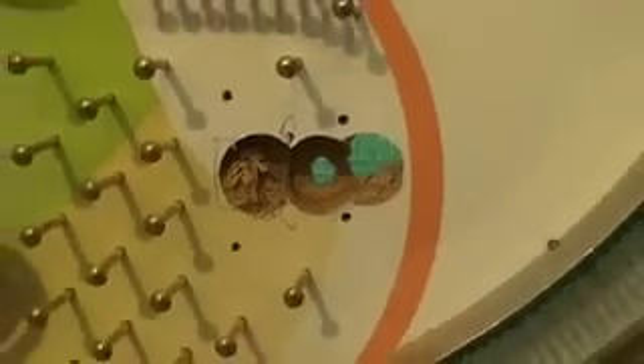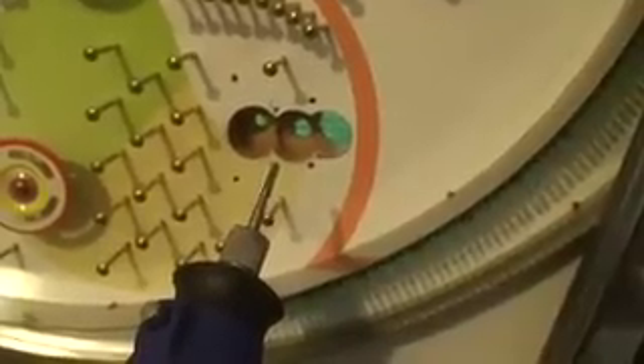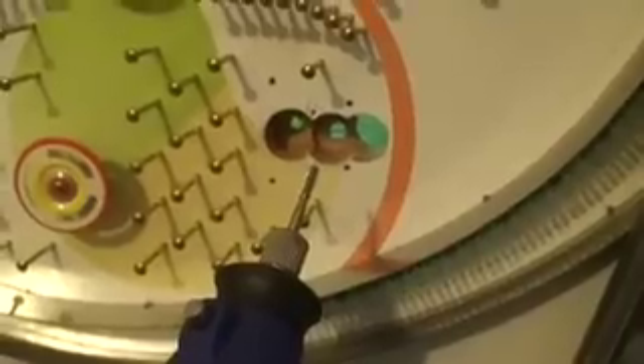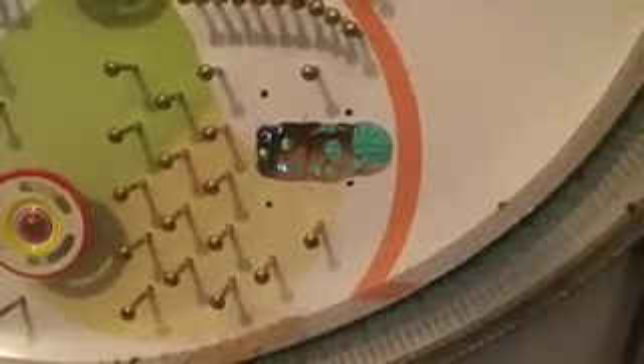So far so good. For this cutting, I'm gonna try this cylindrical kind of cutting bit with the generic dremel tool. I made Swiss cheese out of it — the bit I have is just not side cutting, it's just burning. So I drilled a bunch of eighth inch holes, now we'll try to connect the dots.